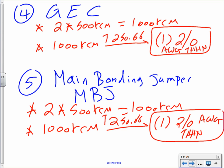Did you guys see how they were black conductors labeled green yesterday, and some of them were bare conductors? Anybody pay attention to the grounding? Yeah. So they can be bare or insulated. Insulated will protect the conductors a little bit. Why do you use 250.66 instead of 250.122 for the number 4? 122, because the code says so. For the generators? For the main bonding jumper, actually, can you guys erase this one?